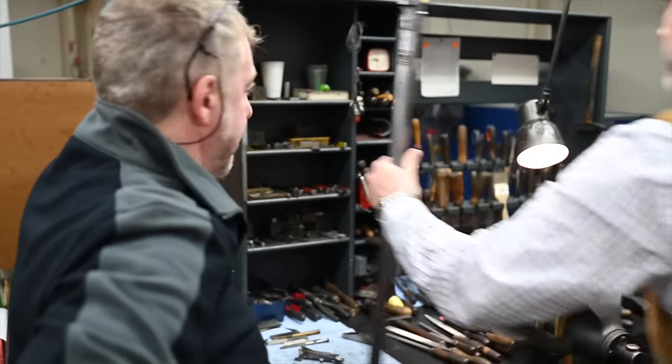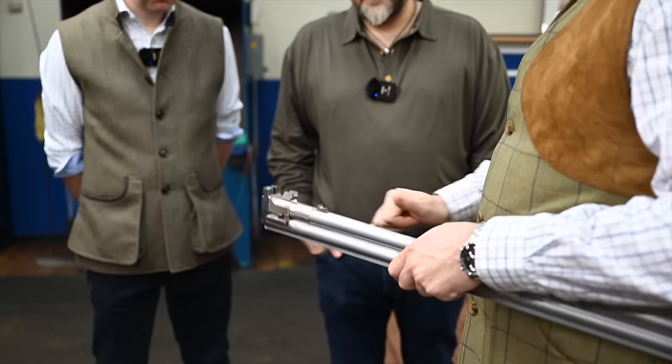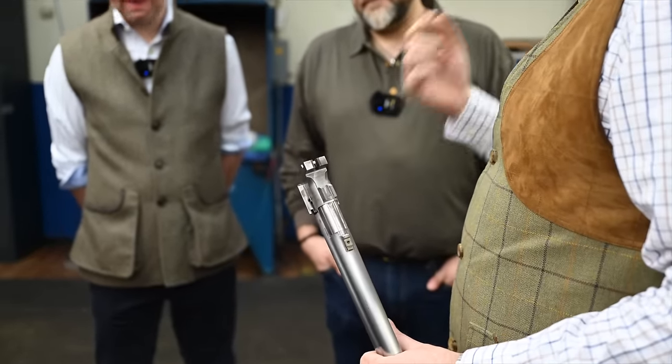And what he's going to adjust will be that zone. Then the recoil surface also. You will see the print of the contact in the receiver, and also the noise will be extremely important, because that rings a little bit like a bell. If it's perfectly in contact, the sound will be sharp and metallic. If it's not good, it will bounce, and the sound is a little bit weird. That's experience. But Brownings always have that noise. When you close a Browning, you can tell it's a Browning with your eyes closed.